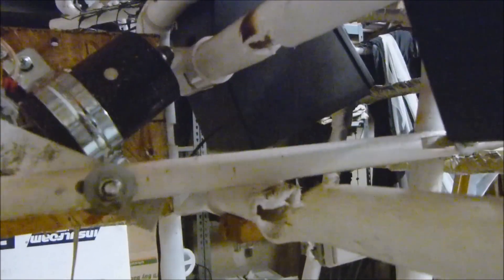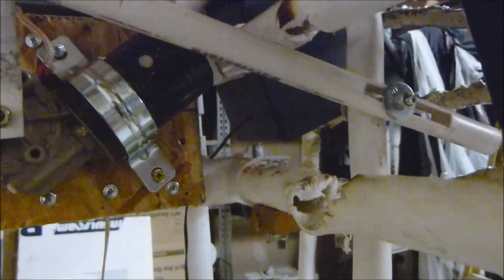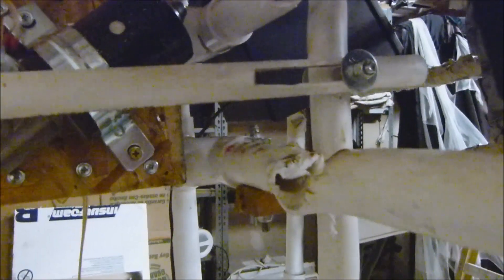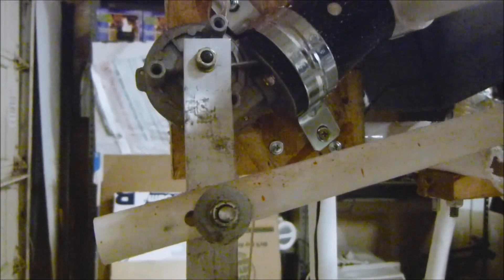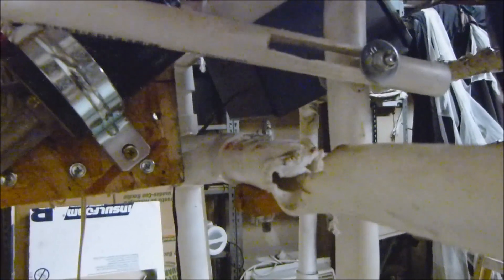You have to first know what the length of the bar needs to be, just as if you were not going to have the slot — mine was 11 inches. I wanted almost a three-inch gap, which is the cutout you can see right there. To do that you actually have to increase the bar attached to your motor by an inch and a half, because it's throwing forward an inch and a half and then coming back another inch and a half, so that ends up being three inches more.